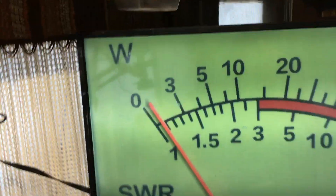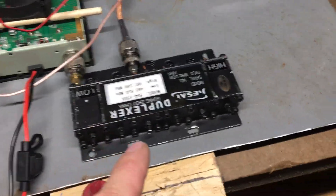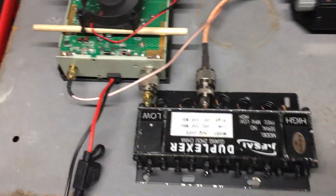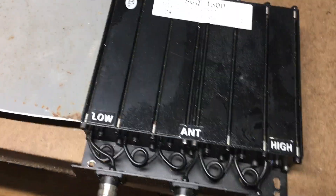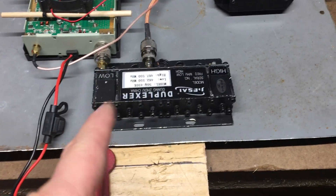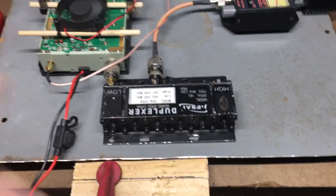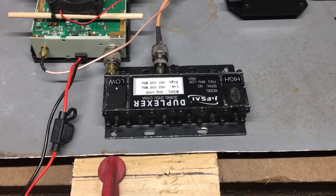That was at a minute 52 seconds when you saw the screen before I unplugged it. This is why they recommend you change that duplexer out. Now if you look at a 50-watt duplexer — which I do have — it's a lot bigger. This is a 50-watt duplexer right here. Look at the size difference: 50 watt versus 10 watt. If you run more than 10 watts, that duplexer is going to start dropping wattage under a minute. How much will vary from duplexer to duplexer.